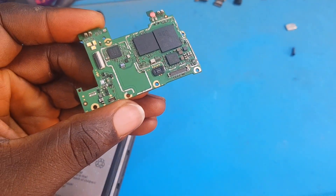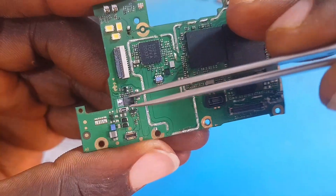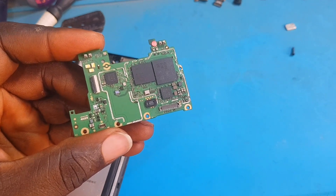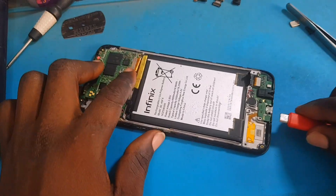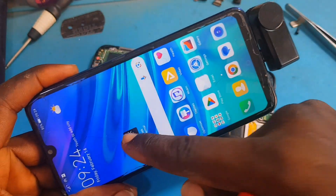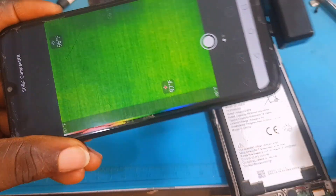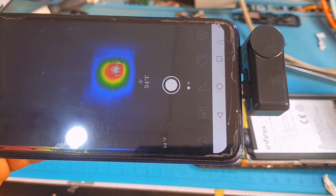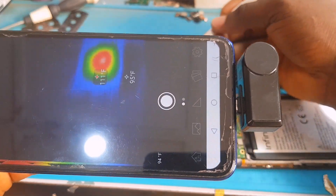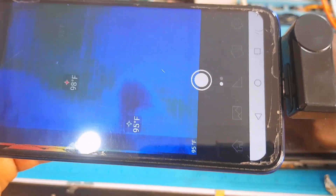That component looks like a diode — a protective component. It is now out. Earlier when I was feeling with my fingers I couldn't even sense that this component was heating up, but the thermal camera clearly showed it. I have taken out the component with my tweezers. Now let's put the PCB back into the casing and switch on the thermal camera again to see if the power IC is still heating up. The thermal camera is on — and the power IC is still heating up. The power IC should not heat up at all, which means it is also bad. The other component's area is no longer heating up — that partial short is resolved.